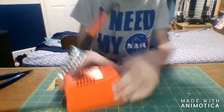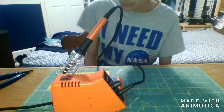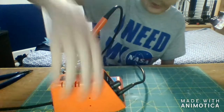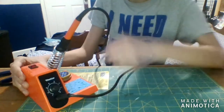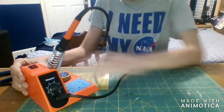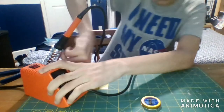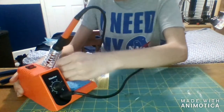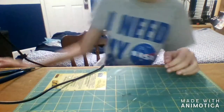You're obviously going to need a soldering iron. In my case, I have a Vastar — once again, not sponsored. I've had this for a little bit of time. You want to look for two things: does it have a sponge? The sponge is used for cleaning — it's an expanding sponge where you add water and it expands. If your soldering iron doesn't come with one, you're going to want to get a tip cleaner. In my case, I have a YHO 8B — it's basically just brass shavings.